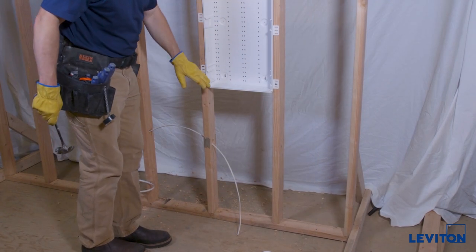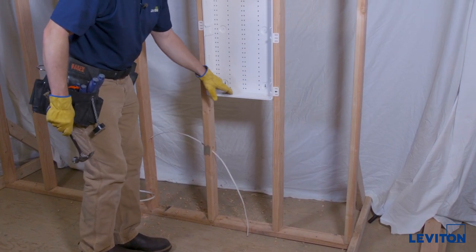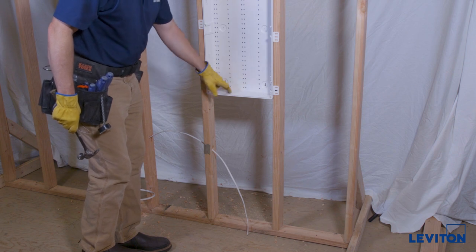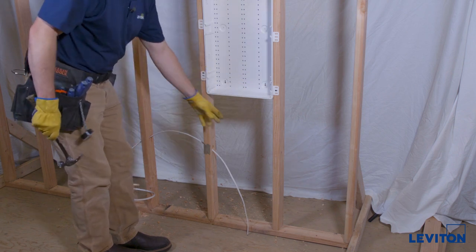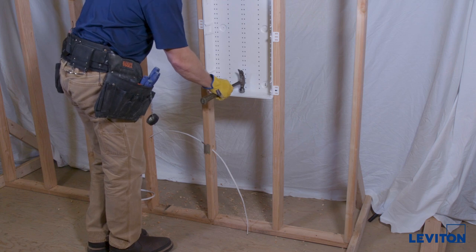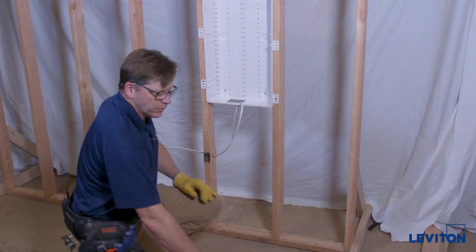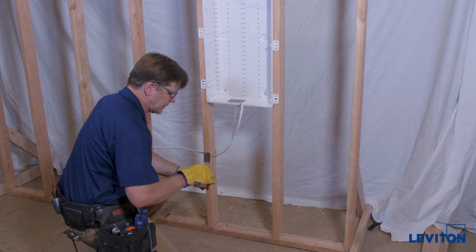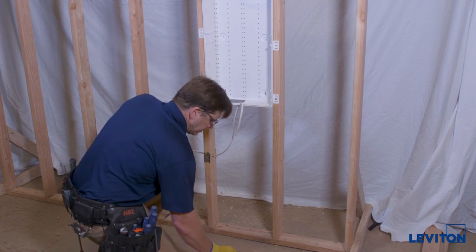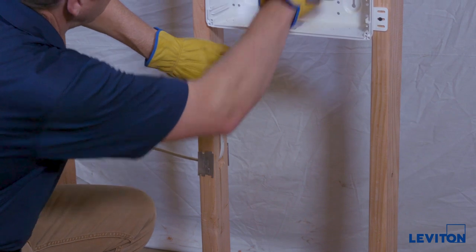Now that we've got our low voltage cables secured and out of the way, we're going to be bringing in our AC power cable using this opening here. There are two knockouts and also one big knockout that can be used for various power supplies. We're going to be using the 47605 ACS, which is a single outlet, so we're just going to knock out this center one and bring the cable up here, leaving it for installation at trim-out phase. We need to secure that cable to the wall stud within six inches of where it comes through the stud and within six inches of the enclosure, so we'll need two staples — one here and one here.